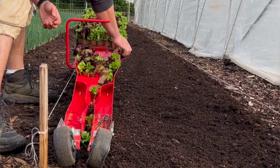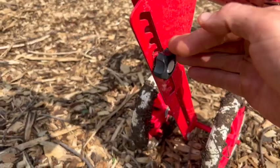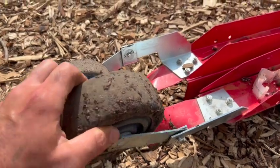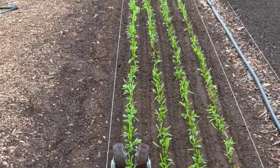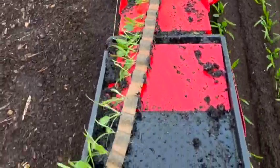While the furrow can close around an overgrown seedling, it won't unravel well and pops up. So I just kind of tear them apart, stage them, and then pull it — it's not a big deal and goes pretty fast, but it took me time to learn that. Nobody really talks about this on YouTube videos. There are also adjustments on the tool — you can adjust the wheels up and down, and adjust the depth of how deep you're planting and how it buries the seedlings after they're transplanted into the furrow. That's going to be different for everybody's soil conditions. It took a lot of fooling with to get it just right, but now I just leave it the same.